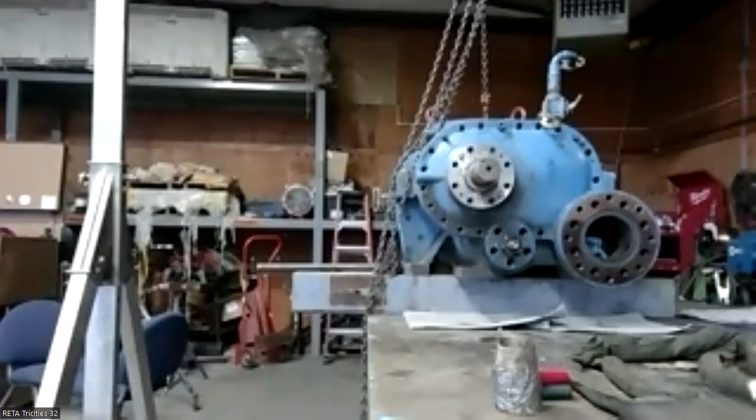I was at Tyson the other day. Really? Yeah. Luke was telling me they lost a bunch of bridges, and the new bank they put in is not maintaining the suction now, it's always too high. The main has a 6-inch suction with a fan control, but it also has a big old equalizing pipe straight to suction down at the evaporator, so that's not really controlled.